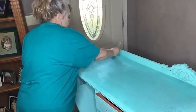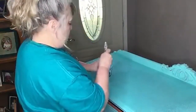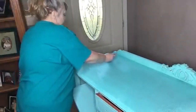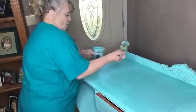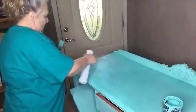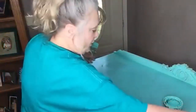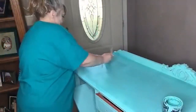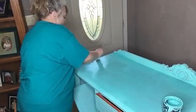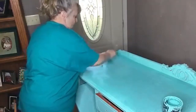My plan was, if I had had a smooth roller, I was going to come in this morning with a paper bag or with that blue scrubby and moisten a little bit more and sort of sand this texture down, you know, just sort of buff it down, and that would have very well worked. But because I didn't get enough coverage out of the two coats that I put on here using that roller, it really needed another layer of paint. So that's what we're doing.